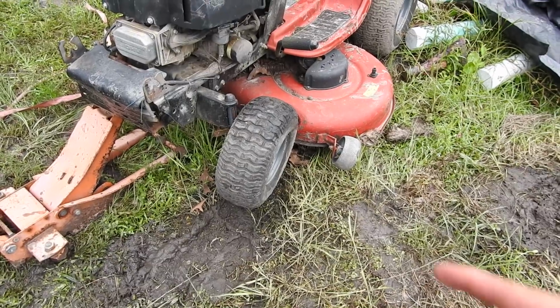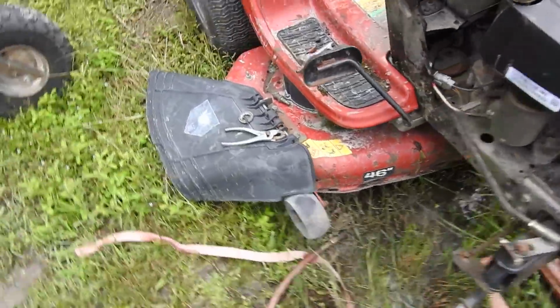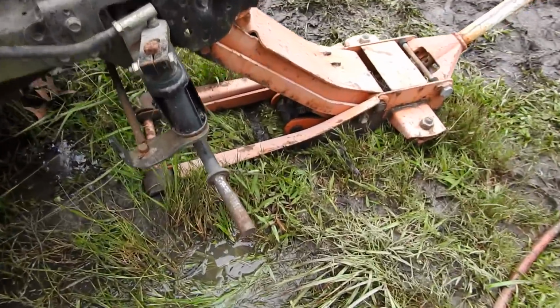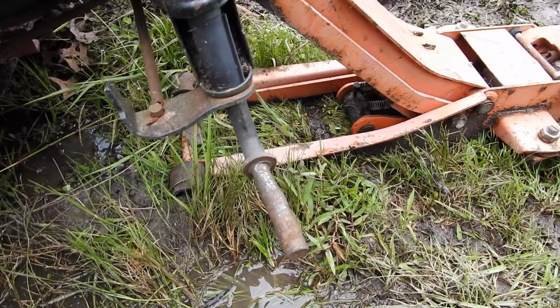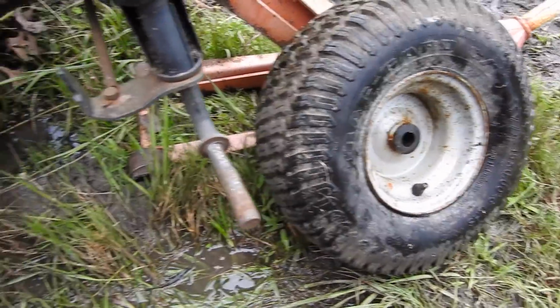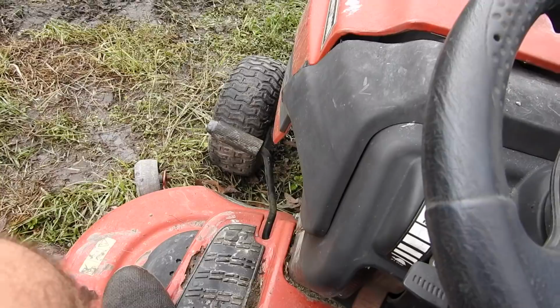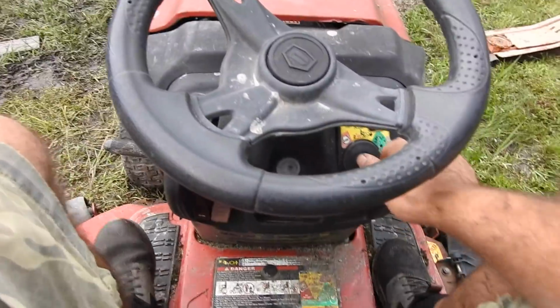I just took the ratchet strap, wrapped around this tire, aired it up. The other tire, it was wobbling all over the place, like the wheel's missing a bushing. And it's not been greased since this thing was new. I don't even know if they greased it at the factory. So I've got this other wheel I'm going to stick on there. It's already got air in it. I'll put a little grease on the axle. All four tires are now aired up. Let's do that test drive.